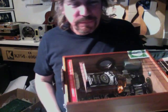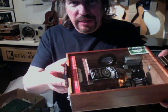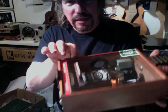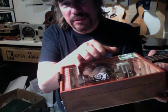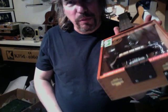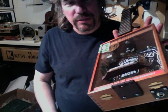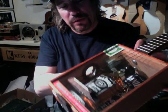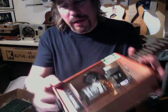The other thing with the bridge — it's got a floating bridge and I've actually put the piezo element in this. I laminated the bridge up out of three pieces with a narrow centre section, so I formed a little pocket in there to drop the piezo in so I didn't have to bother routing it out. The cable goes through to the little tone and volume control here, with a bone saddle and a bone nut.